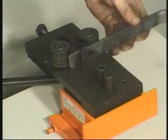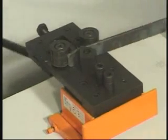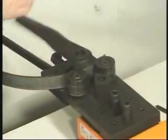It's now time to form all the bends using the master RBR or industrial strip worker. Use the end stop screw to ensure accurate, repeatable bends. With a winding handle fitted to the strip worker or master RBR, identical type curves can be rolled time and time again.